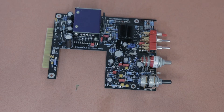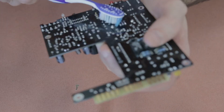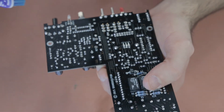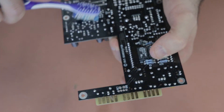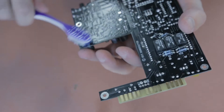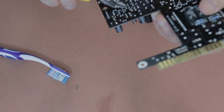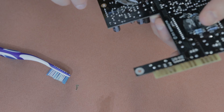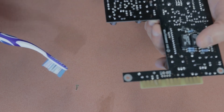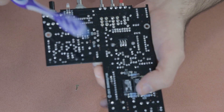That's basically it for the main PCB board — all major components and transformers are in, and only the DI needs to be added later after testing. The next step is to clean the back side of the PCB — get it nice and clean of any solder bits or flux using a toothbrush and some isopropyl alcohol. Also do a visual inspection for any solder joints that aren't 100% and fix those up.